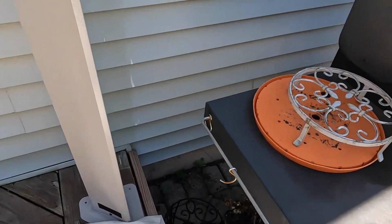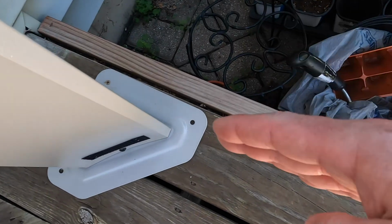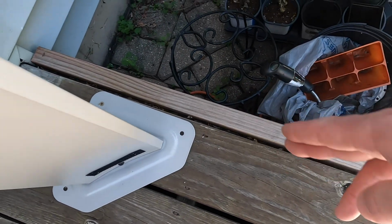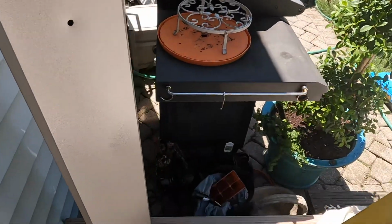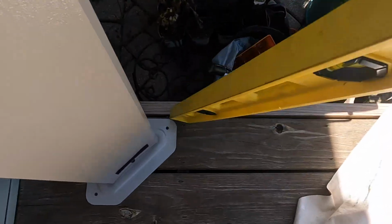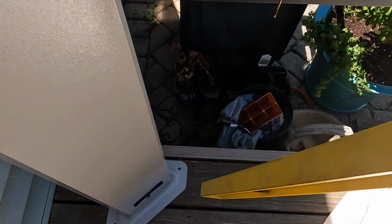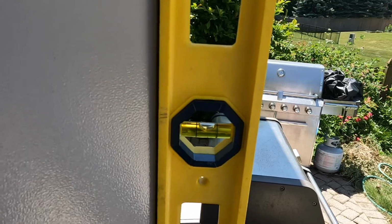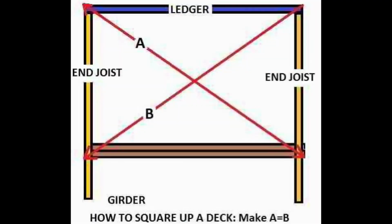but it's still, things are off. So I was counting on it being the same this way. Once you get these sides in here, this is when you need to square it up. So I put it in, where it should be square or straight along this deck line here. And then you've got to plumb this out, and then you go from there. So you got these 2 sides ready, and then you've got to square everything up. If it's not squared up, things aren't going to line up.